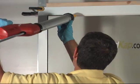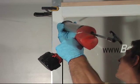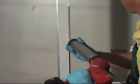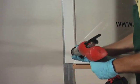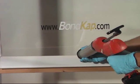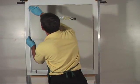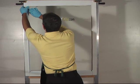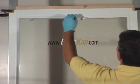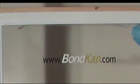And once again, with the square frame doors, it is better to apply the silicone directly to the door. And now we can press our pre-cut BK2003 onto the door. Now remove the excess silicone, finish off with a plastic razor blade, and we're done.